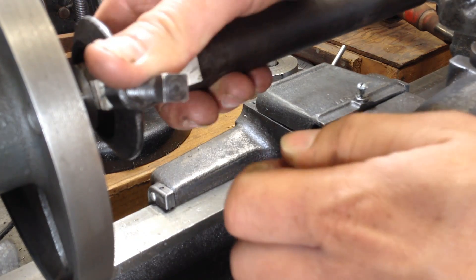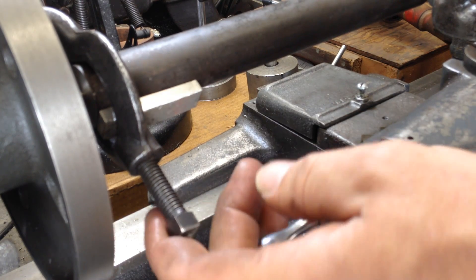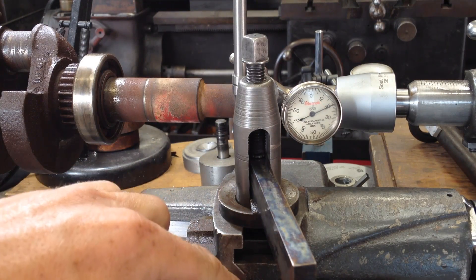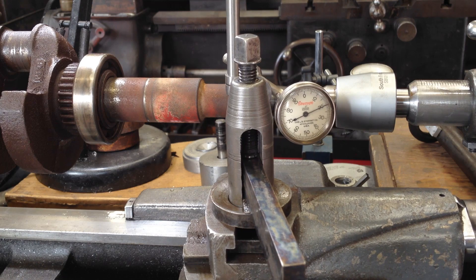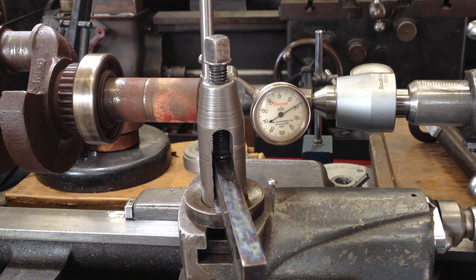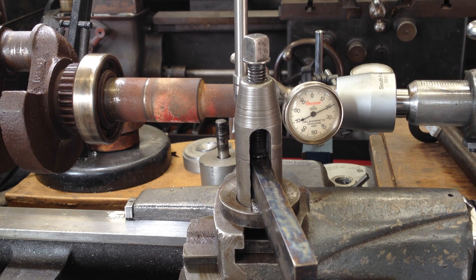This is not going to be fun right here. That's going to be a very good way to get my finger beat up in a hurry. I just flipped the compound around and realigned it according to the grease mark down here, which is a little bit out of frame. Boy, did I get close — that's 20 thousandths right there, and 18 thousandths right there. It might even be off the shaft — yeah, it's still 18. So within 2 thousandths, just using the degrees on the compound. That's not bad, that's a good starting point. I'll fiddle with it a little bit more here.